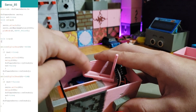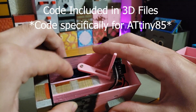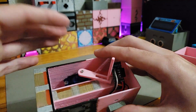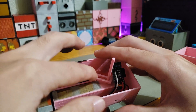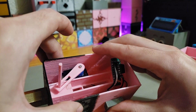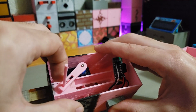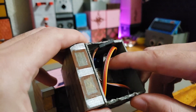I'm using the software servo library to control the ATtiny85. The code causes jittering inside the servo, so you can just hear it jumping around. Even after optimizing the code there's still some jittering, but the jittering does not affect the piston itself — if I extend it, it'll hold there. You can hear the jittering but it won't affect the shaft itself.